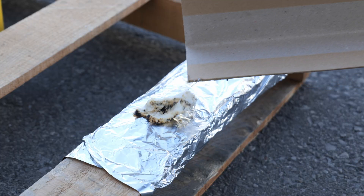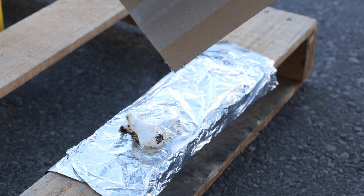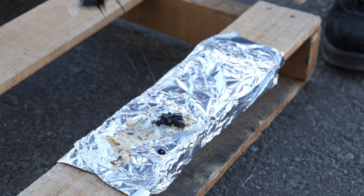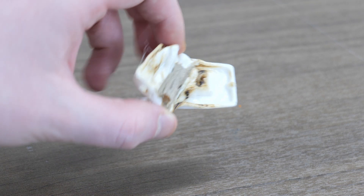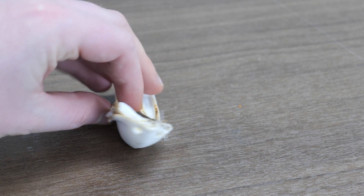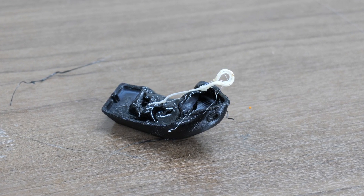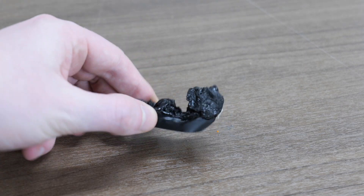The results mostly went as expected, and I think we got a good visualization of what the FRV0 rating means. The plastic did catch fire, but it self-extinguished pretty quickly. They all did catch fire and melt quite quickly, but the higher temperature ones lasted a little bit longer. The problem with this experiment was that the propane torch was a little too powerful — if we had used something weaker, like a lighter, you would see these differences much more magnified. But I did notice a slight difference with the higher temperature filaments, and the FRV0 ones did extinguish themselves very quickly.